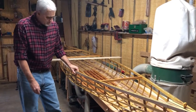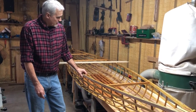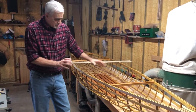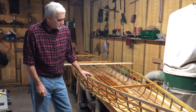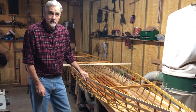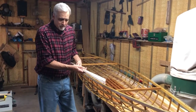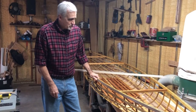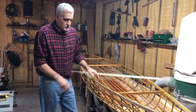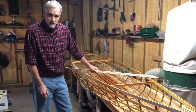I think it's actually even tougher than the oak. Once it's in the boat and it's set, the oak seems almost brittle — I don't know if that's because I did something wrong to it, as I was using kiln dried oak. With this poplar, I soaked it for about five hours in a hot water soak and then did about 30 or 40 minutes in the steamer. It bent beautifully, held the shape beautifully. Very happy with it. I'd highly recommend trying poplar for the ribs.